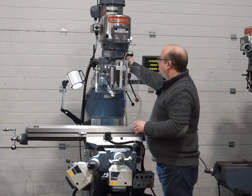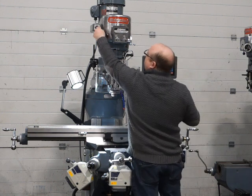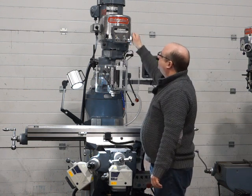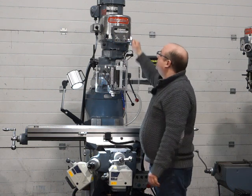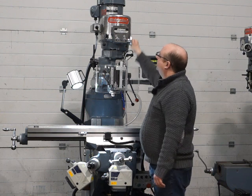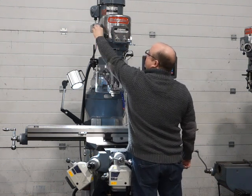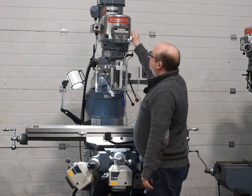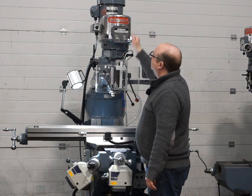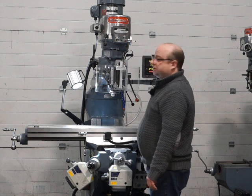Move that out of the way, then I depress the handle on the right, turn and lock it into the low range. Just occasionally you have to turn the spindle to get the dogs locked — watch out for that. Now we're at 120 RPM because we're in low range. That's 260 in low, back down to 60, and about 130. Reversing the spindle now — just as quiet in reverse. Back down to 60, then 300 RPM, and back down to 130 RPM.